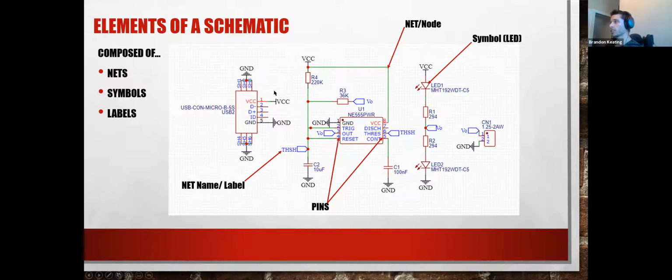The other important thing is trying to do this as cleanly as you can. You want clean schematics. I'm going to show you guys a really, really ugly schematic later from the 90s. And I'm only an electrical engineer and I can't make sense of it without a ton of scrutiny. So you want to do isolated design. These are all still connected to one another, but they're in strips here. There are no peripheral lines coming off of this. We're using net labels to make this happen. Yeah, that's about all of that.